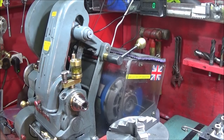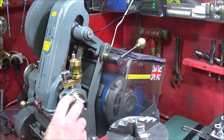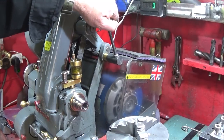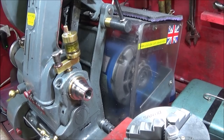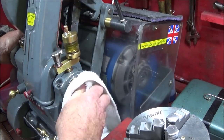To put the chuck back on the spindle mandrel of the Myford ML7 and lock the spindle for screwing the chuck on — because it's quite a heavy chuck — sometimes when you go to screw the chuck on the spindle will turn. I pull the lever up into the drive position which locks the spindle, then clean the threads with an old clean towel from charity shops or wherever.